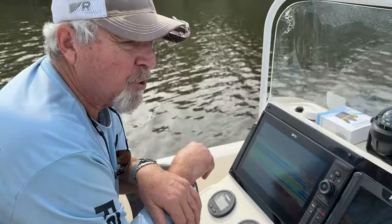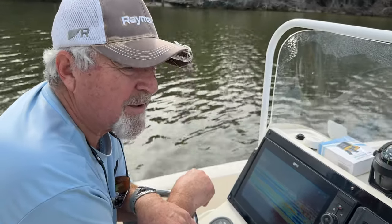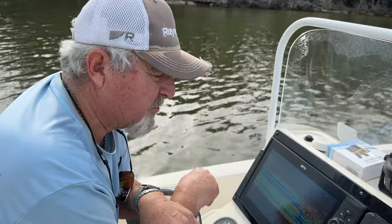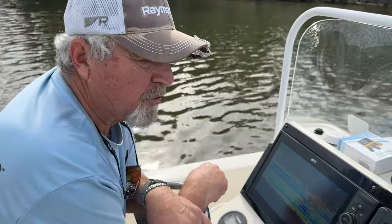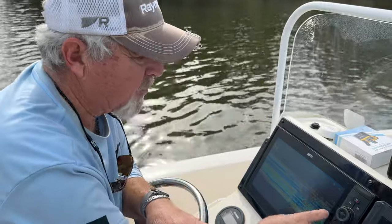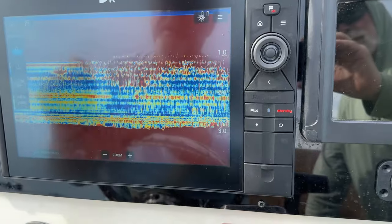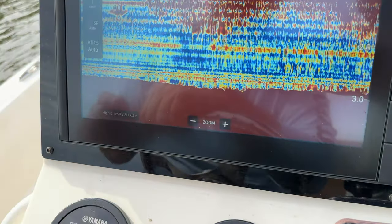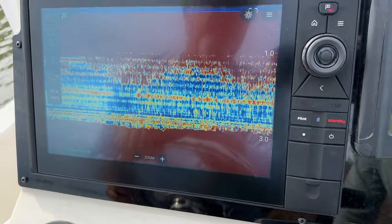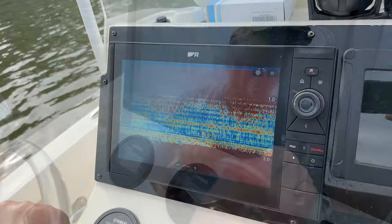It's very important that in a lot of conditions you can do a better job than the machine will do — you can see more fish targets, better bottom structure, thermoclines, and different functionalities when you play with your sensitivity versus the standard auto setting. Standard auto settings do a good job for the most part for somebody who doesn't want to mess with the machine or doesn't fish that often. But if you're a serious fisherman, learn to play with your sensitivity. And remember, if you get all messed up, simply go down to the bottom and turn it back to auto — it will reset and let the machine do it for you.